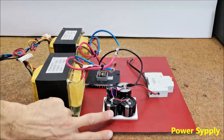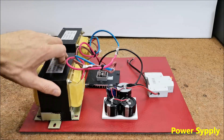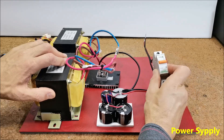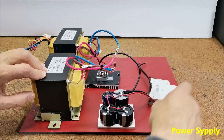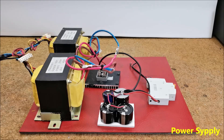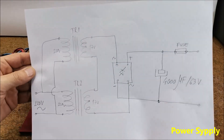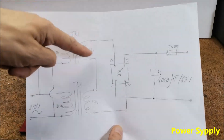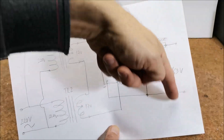Next is a filter of several electrolytic capacitors with a total value of 4000 microfarads. For safety I also installed an automatic fuse, initially with a value of 20 amps. To make the connections clearer I made a simple wiring diagram, showing the transformers, primary windings, secondary windings, bridge rectifier, capacitor, fuse, and output.